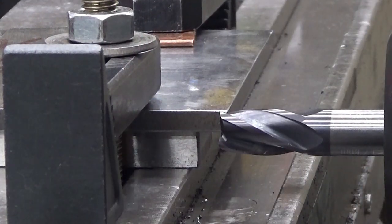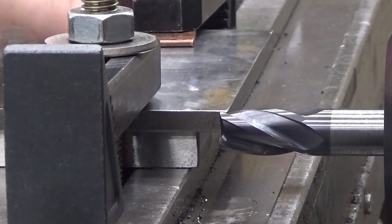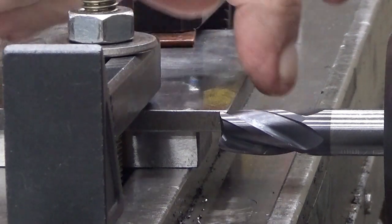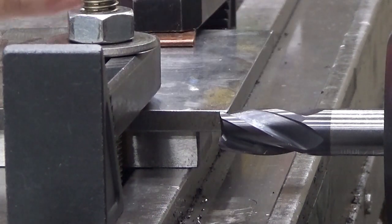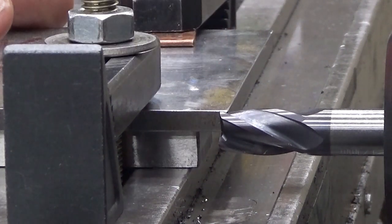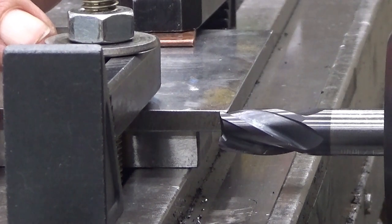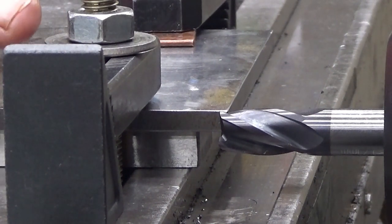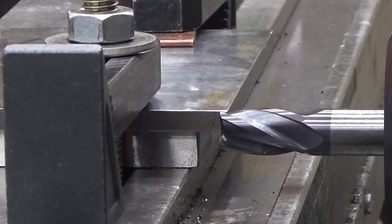Well, the side I just milled is now on the downside. And next step is to mill the dimensions correct. So we should have one straight edge and then two perpendicular edges with that one, and the distance between those should be 99.95 millimeters. I'll measure more accurately what it should be, but I will now do three sides for this workpiece. The first one is this, and I'm peeling off only half a millimeter here.